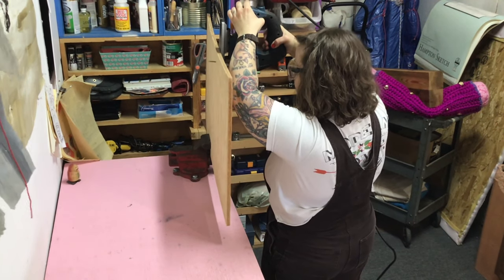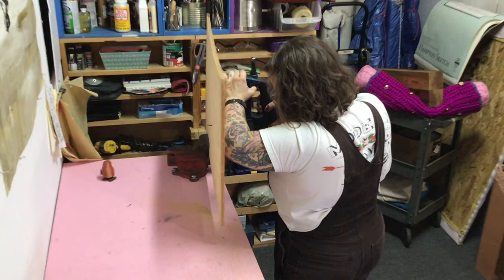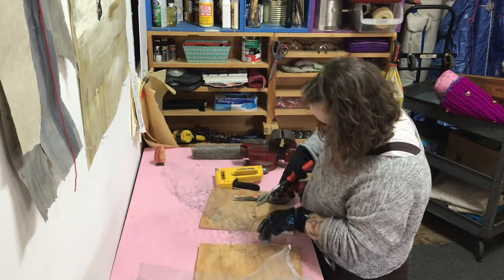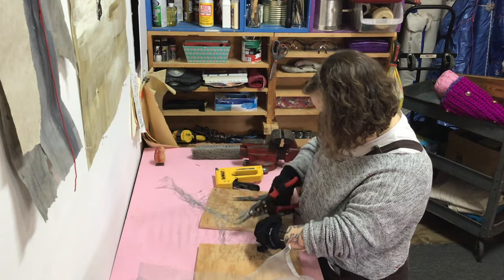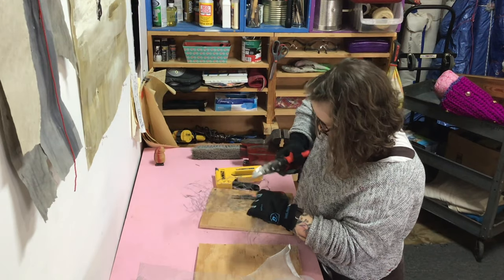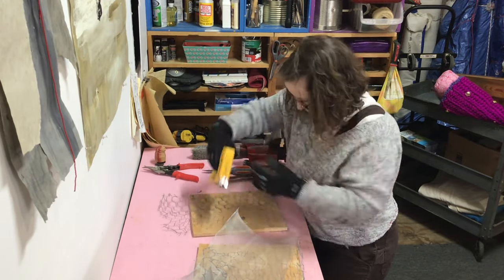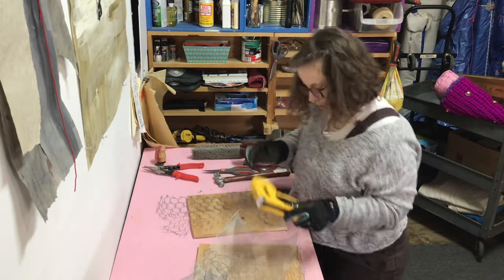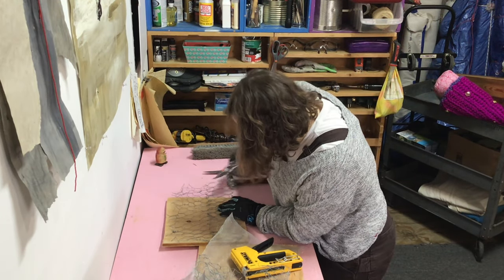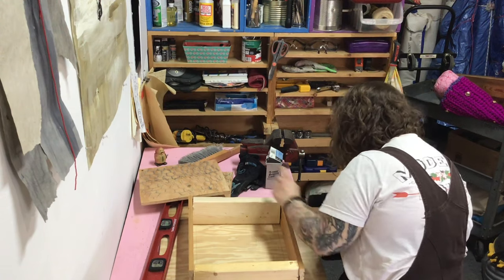I am here making a mold for a largely two-dimensional concrete piece that I plan to use as a relief and something that I can paint on. It's also a good way to make any other kind of casting you're looking for, as long as you're not going functional. I'm preparing the board that is going to be the main fixture. I want to make sure it has some tooth. When you're casting concrete, it's really important to make sure that whatever surface or armature you're using has something for the concrete to attach to. If the concrete just goes up to the board, it will have a very high likelihood of fissuring off. If it has any stress, it just makes it more stable.